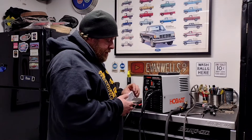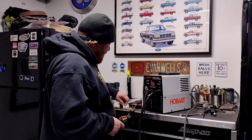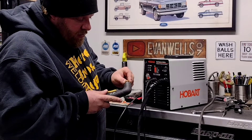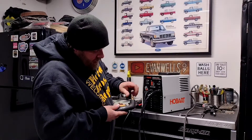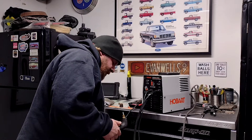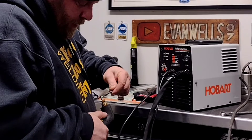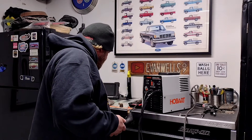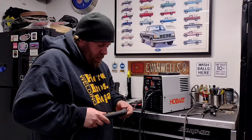Just grab a couple out of here and start popping this thing back together. The first thing that goes on is the little swirl ring — it just sits in there that way, there's a little bit of tension. The electrode then just screws on — give that a little snug with a small quarter-inch wrench; I'm not going to crank it on there. The tip slides in nice with a tight fit, and we'll pop this all back together.